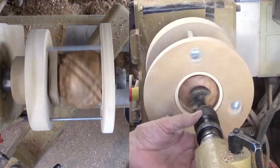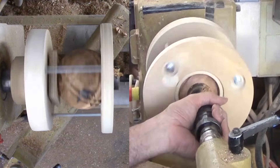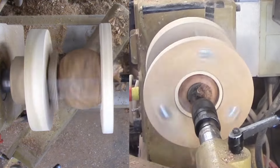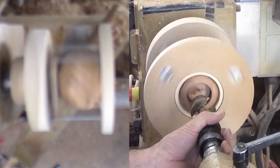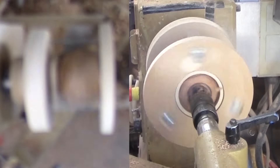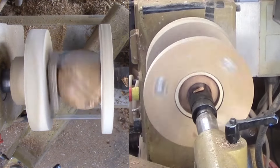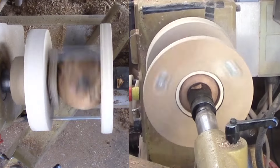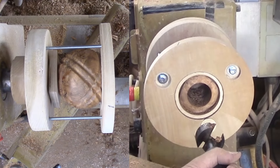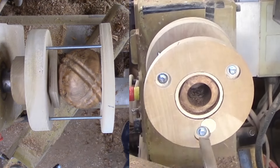I could stop now except that my sphere is quite heavy — so let us hollow it. I have set up my DIY donut chuck. This chuck consists of a large faceplate and matching outer ring. I choose a quarter-inch hex bolt from an assortment of bolts of various lengths. Three of these bolts cinch the outer ring to the faceplate — three bolts are easier to cinch uniformly than four. The faceplate has a three-quarter inch hole to accommodate a variety of fixtures for different project styles. The outer ring has a mortise to accommodate different diameters for different projects, from faces to spheres. I'll take it easy on myself and bore out a three-quarter inch center hole, though I do need to sharpen this Forstner bit.